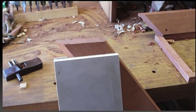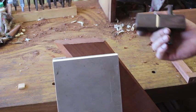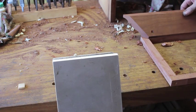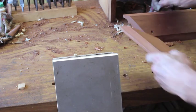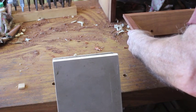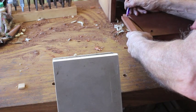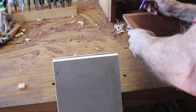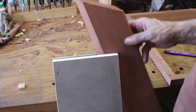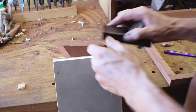There you see the completed joint. A little palm smoother again. I'm now going to fit the corners together. I've fixed the front corners in place and then match the side corners — bring it up into position, work out where you need to. It's pretty hard to get it right straight off the drop saw; usually there's a bit of fiddling with large cornices like this.